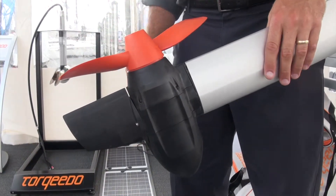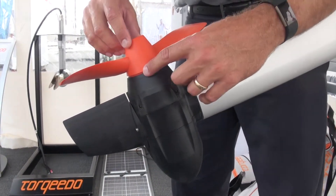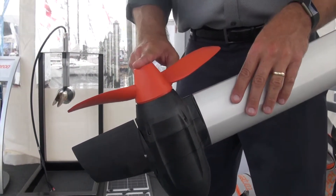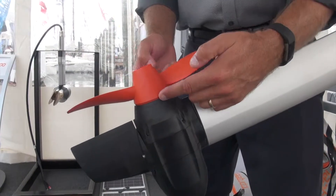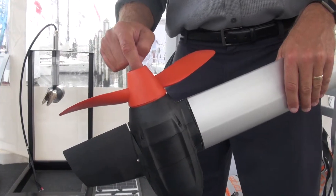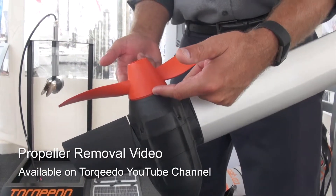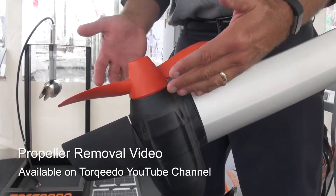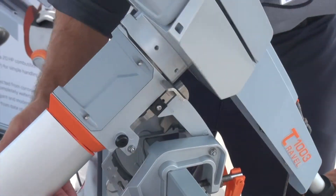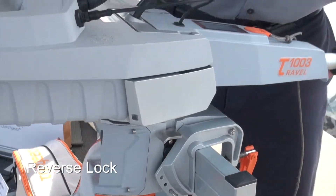Occasionally the motor is used in areas where people are fishing or where there's vegetation. Fishing line can get caught in the prop, or sub-aquatic vegetation, and over time that can wear through a seal inside. Use a 17 millimeter socket to pull the prop every couple of trips and make sure there's no fishing line or vegetation underneath. If you see any, clear it and put your prop back on. If you run shallow, the motor will kick up unless you want to use reverse, in which case the reverse lock lets you engage the reverse gear.